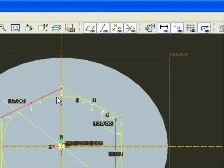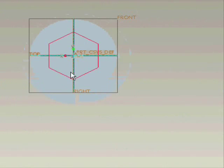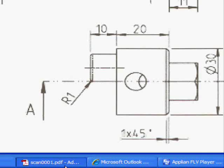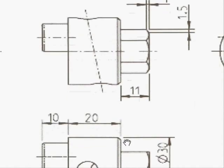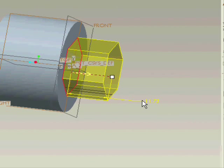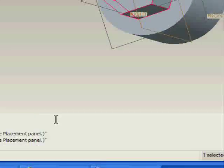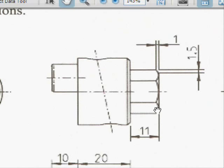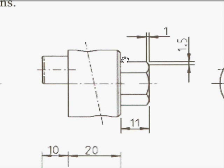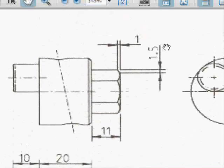Now we can delete the internal circle — select it and press the Delete button. We are done with the sketch. We go to the Extrude tool and the height is 11mm as stated. We double-click on the dimension box, enter 11mm, and press Enter. We now have our hexagonal nut. All that remains is to make the chamfer that makes it look like a real nut — 1mm from one side and 1.5mm from the other.